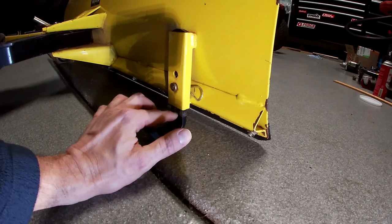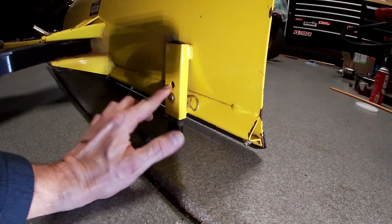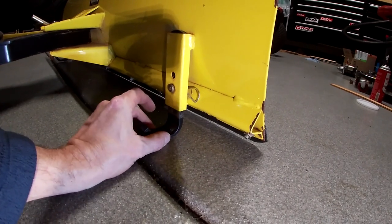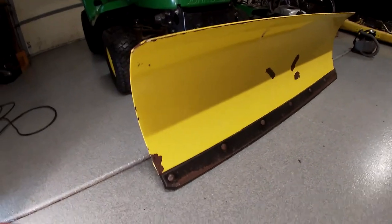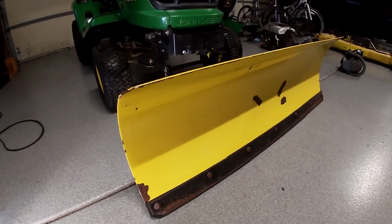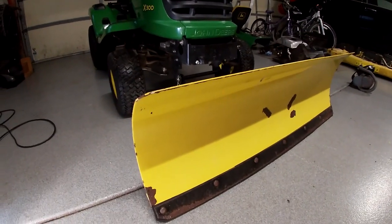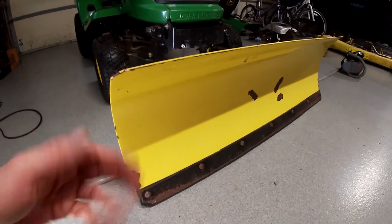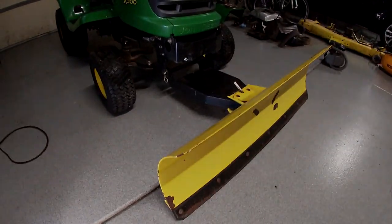There are multiple holes in this skid and there are two holes up here on the blade that you can choose from, so you've got to get it set where you want it and then try to find the next closest hole. Overall I'd say it turned out pretty well. I'm anxious to use it and see how it works out, but then again part of me hopes there's no snow — so by doing this, hopefully I will ensure a mild winter. Hey, I hope you found this useful. Thanks for watching.